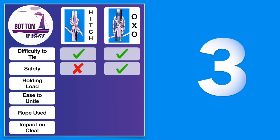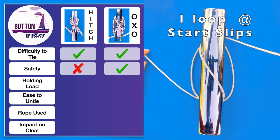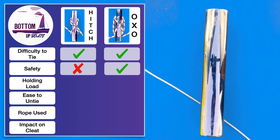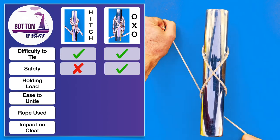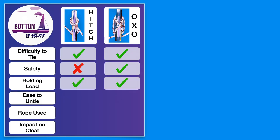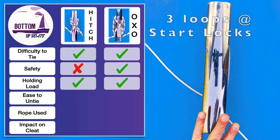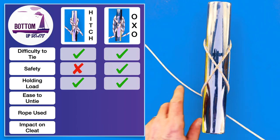The third and probably the most critically important factor is the holding load. In both these examples we have the rope size matched to the cleat, and so the standard way of tying both knots will secure most vessels as the rope tightens on itself around the cleat. If however your rope doesn't match the cleat — for example you have a thinner diameter rope with a large cleat — that'll actually slip. In making this video we did several tests and the loads turned out to be equal, as the rope got thinner with the amount of additional turns needed at the start of the knot to ensure no slippage. So for the holding load we're going to rate them as equal across a range of rope diameters and cleat sizes.